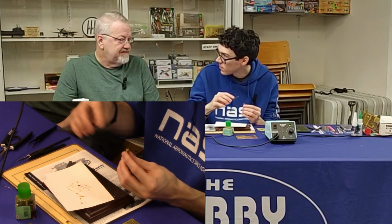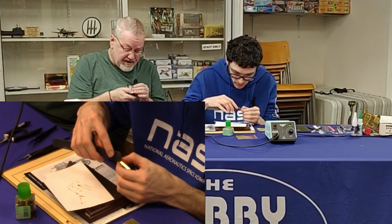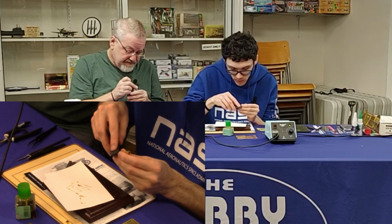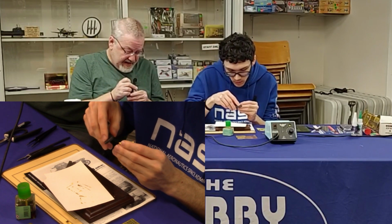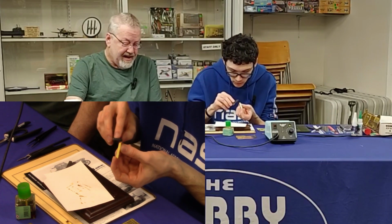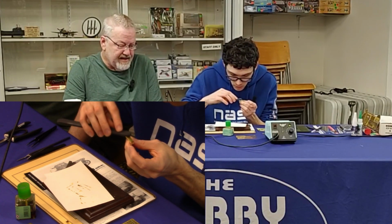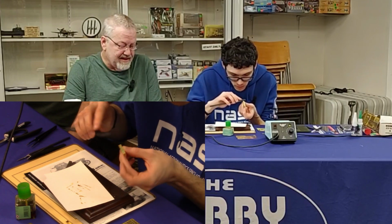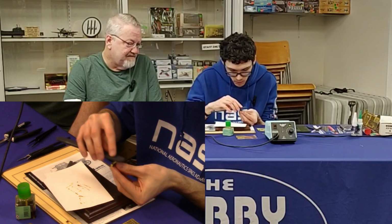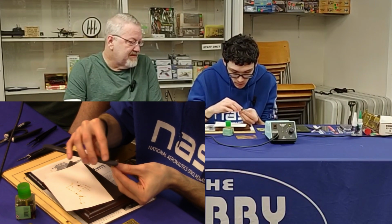Is it lead solder? It's lead. It does have a certain amount of silver in it, so it's not as, I'm trying to think, cautionary. Yeah, it does contain lead. I had to do testing when I worked. We had an employee who had some health issues, and we got all of the government supplied tests to measure fumes, and it was almost a negligible amount. So with her wearing a mask, that stopped any kind of issues.